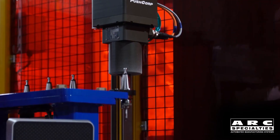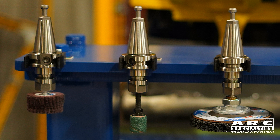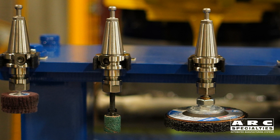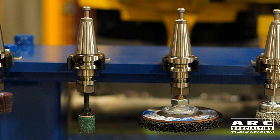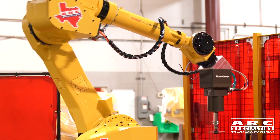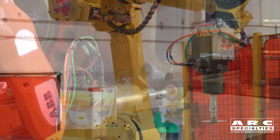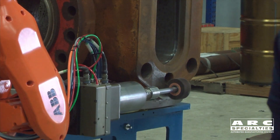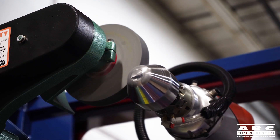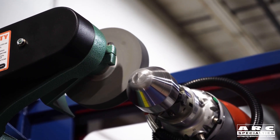On this job, we're using an automatic tool changer and a variety of tools. We needed a combination of flap wheels, disc sanders, and wire brushes to remove the flash left over from the elastomeric molding operation. All these tools wear out over time, and as they do, our closed-loop system automatically compensates for changes in tool diameter. I find it ironic that sometimes easy jobs like sanding and polishing require some of the most sophisticated sensors and control algorithms to successfully automate.